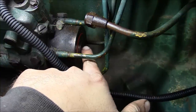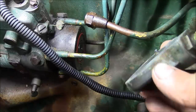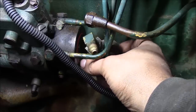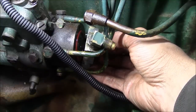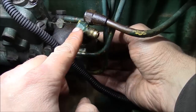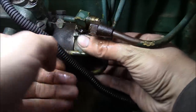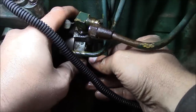Okay, I got the vanes put back in the little impeller thing here and I put that O-ring back in. Hopefully that thing doesn't leak. I don't know if that kind of silicone stuff is factory or that was some kind of an expedited field repair. There's a roll pin in the back side of this cover that has to line up with a notch in the outside of that little impeller pump. Yeah, we might as well start with the hardest screw.